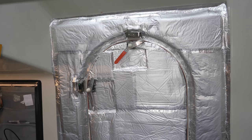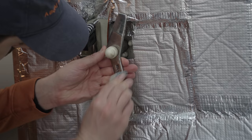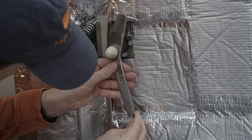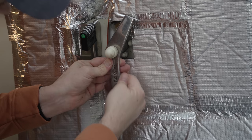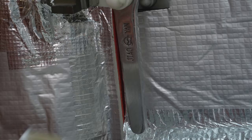In extremely low temperatures, any metal fixings spanning the interface between inside and outside the boat will conduct cold inwards — or rather conduct the inner heat outwards. In any case, these handles will be very cold to touch. We're going to coat them. This won't stop much of the heat loss, that would require a redesign, but it will prevent cold damage to bare fingers. First, I need to bring back this polished stainless steel to a rough key so that it can accept a primer.